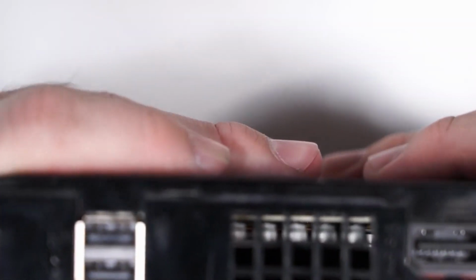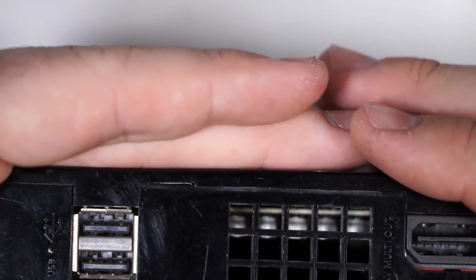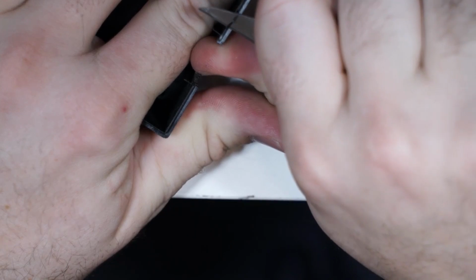So you can see that the top half of the case cuts off almost the entire HDMI port. So you need to trim it out. What you're going to do is go ahead and mark the position again. Then there's a little lip here of plastic that slots into the other half of this casing. So you're going to trim that portion where you marked it first. And you are going to have to go deeper than that, so that's not the whole install. Be nice if it was.